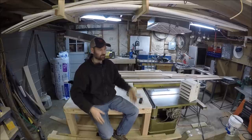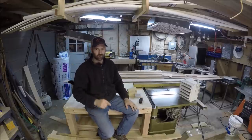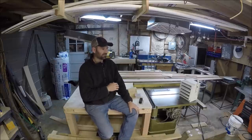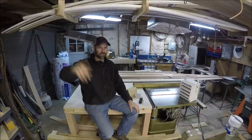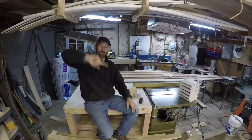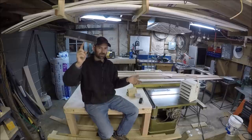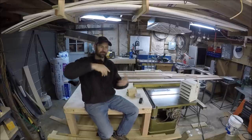It's not rocket science. The roof isn't going to blow off if you're one short or two short. But if you're like 10 short, you're going to have some ventilation problems because it's not going to be able to suck in as much as it's going out. Oh, and the roof vents should match the soffit vents so you have equal in and out.